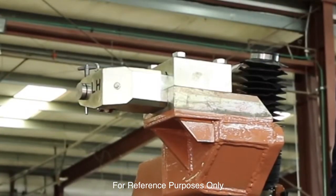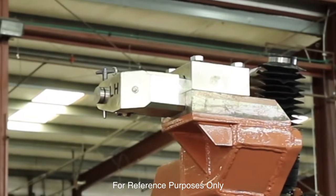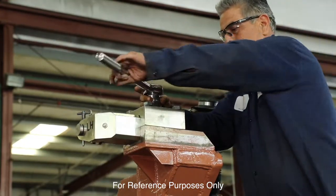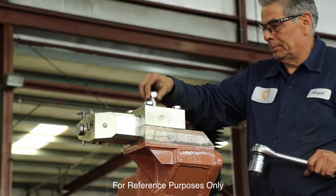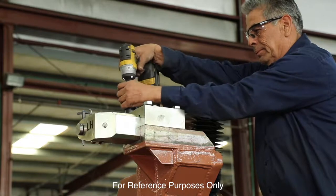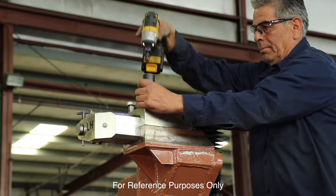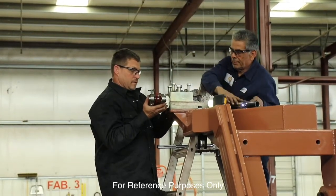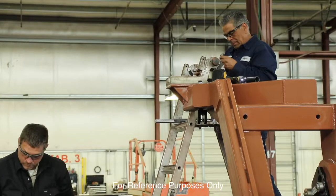At this time we're going to remove the left and right front heads. This is how they come when they're in the truck position. There are four bolts on top that require an inch-and-an-eighth socket, and an inch-and-a-half center bolt. We're going to take them off and install them on the engine flange with the flange adapters, which are with the front engine mounts. You can see the flange adapter, which is part of the front head pin — you have to remove this and install it on the engine prior to pinning the front mounts to the fan case.